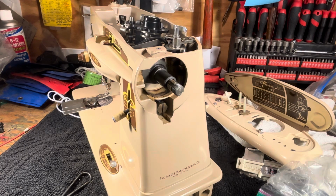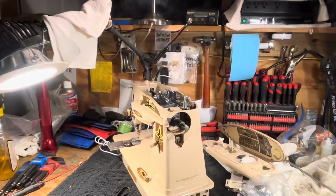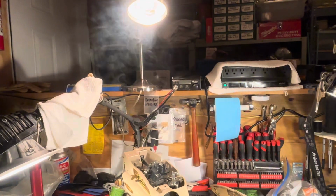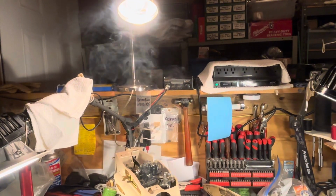We're already at the 2-minute mark right here. We're running it. Here it's picking up speed, surging. Drops back, picks up. Sometimes it goes down to where it's like going to completely stop. Everything that you're going to experience, I've experienced. Hold the pedal to the floor, and you can see the smoke. There's the smoke. It's rolling off of it. That's oil. Good Lord, people. Don't oil these motors. Blue in the face.